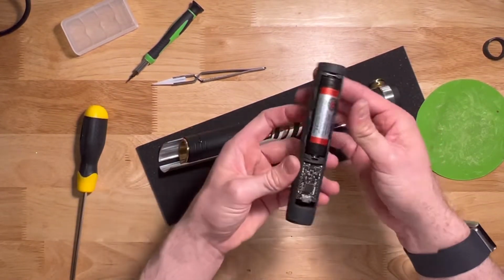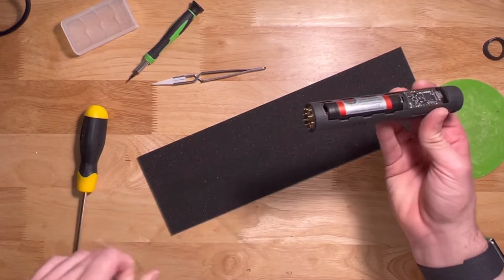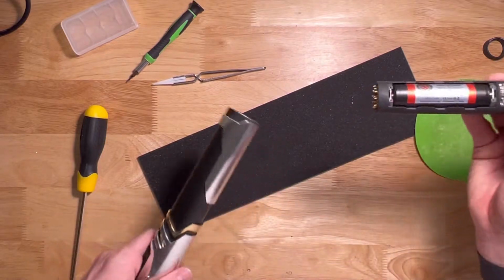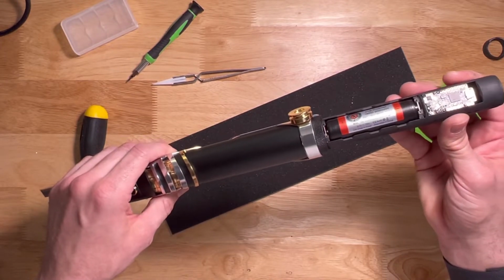When you put it in, you get a boot sound. That means we got power now, it's operating. Whenever you put the battery in and you're handling the chassis now, you need to be mindful that now these pins right here are electrically charged, right? The battery's giving them power. So we don't want to touch those to anything metal because that would short and fry our electronics. So be careful when you're inserting this, just go straight in, right?